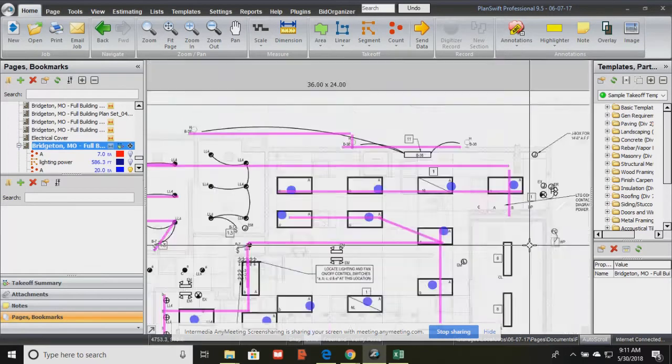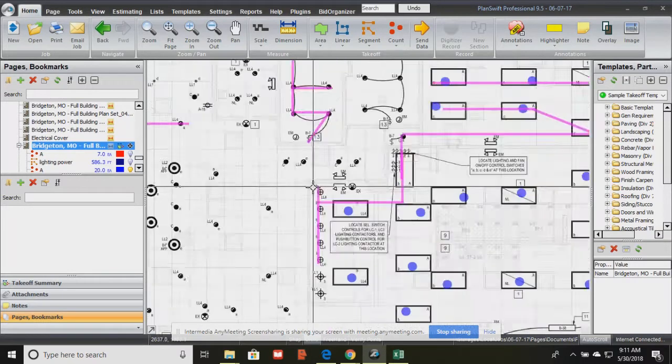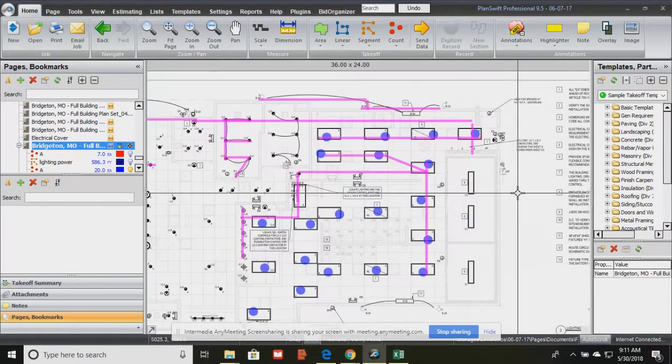They just show you here where the switches are located for the control panel, but they don't really show you where the panel is located. So keep in mind, in electrical, we're only talking about electrical. We have two plans. One's the lights and their controls, and one is the power we haven't gotten to yet. So anything related to power will not be shown on a lighting plan, okay, period.